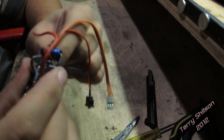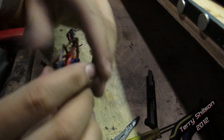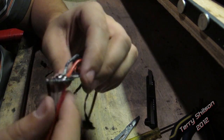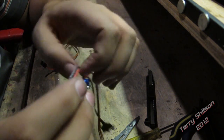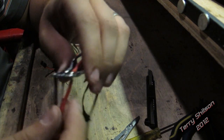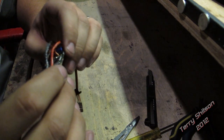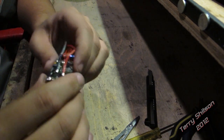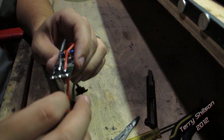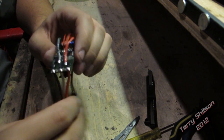Additionally, I'm going to pull the power and ground wire out and run a solid wire from one to the other — just strip a portion of the wire to bridge it onto these and then out the back, and that will go to my battery. I may also set up my BEC in here, but I don't have the BEC yet, so I'll just put the BEC on the Dean's connector when I'm pretty much done the truck. It really sucks soldering on these boards because they put some sort of plastic coating on it and you've got to melt through that — it is a pain in the butt. But it's well worth it to have such a small, light footprint for your speed controls.